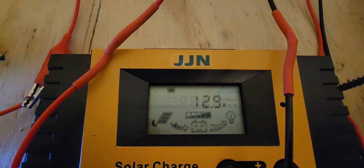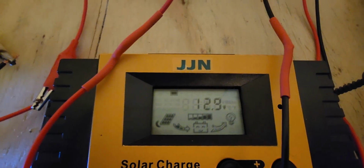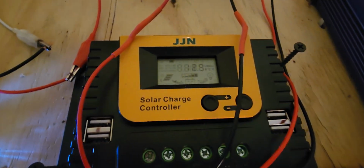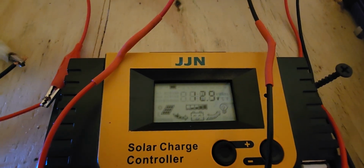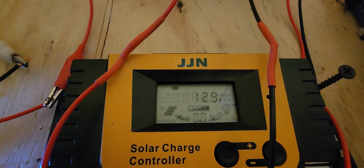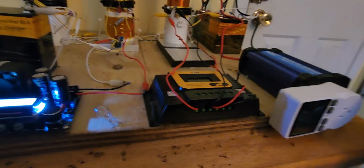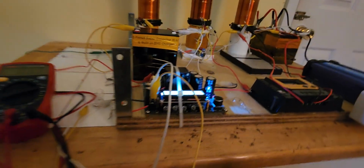And it'll say 13 soon. Something with the efficient charge circuitry in the controller really helps as well. This is MPPT. So next I will turn the inverter on. I'll run a load here, and I'll try and bring the system down, and we will watch the recharge effect.